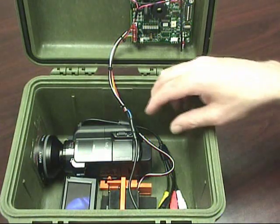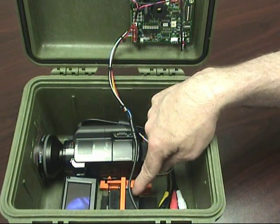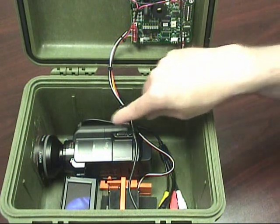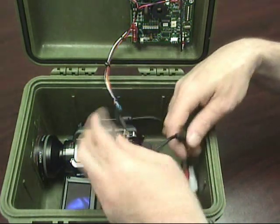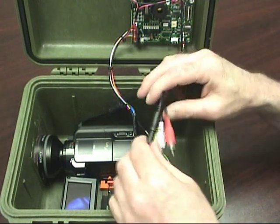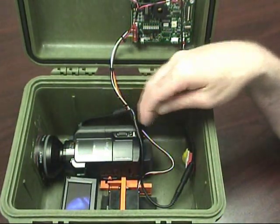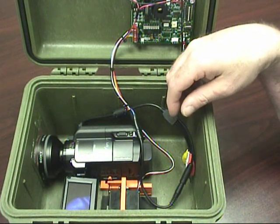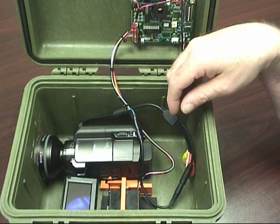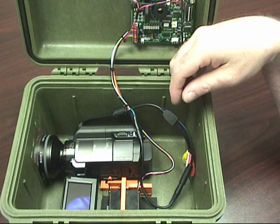Inside the camera system is the camcorder itself. This is the servo that engages the night shot mode, and the camcorder is connected via a LANC interface. We're using a standard AV cable that brings out the LANC interface for the Sony camcorder. This particular camcorder is an HD camcorder with an internal hard disk as well as memory recording, so there are no moving parts — which is a perfect setup for getting high quality video in any kind of conditions, from very hot to very cold.